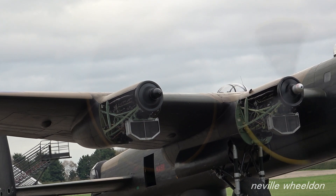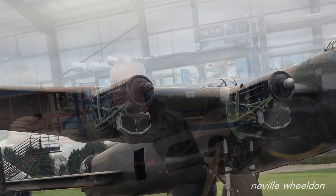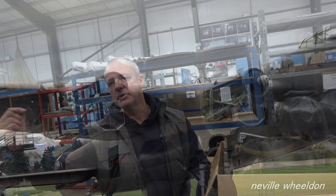When we shut down we had a spatter of oil on the blades, which you can see tracing back from the front dome. You've got to keep your eye on the job, because if your oil pressure drops down suddenly you need to shut the engine down fairly sharply before anything can happen. Right, that was good — thank you very much.